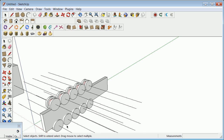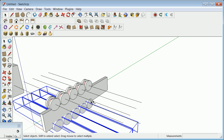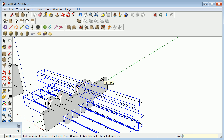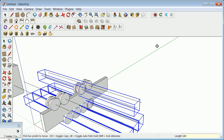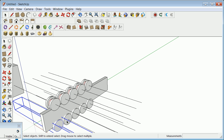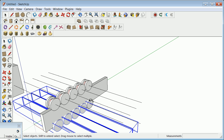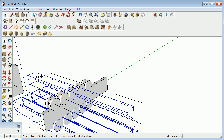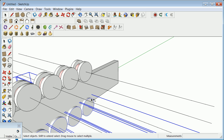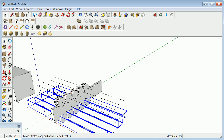Now these, however, you might want to shift. You remember you made this 160, you might want to shift them all 80. So I'm going to grab 1, 2, 3, 4, 5. Realizing that you can, like the relative, you can go here, get it along that distance, and say 180. And I grabbed too many, so I'm going to go Edit, Undo, Move, try to grab them again. 1, holding the Shift key, 2, 3, 4, 5. Looks like it grabbed this one up on top. So I'm holding the Shift key and not grabbing it. Holding the Shift key, then grab that one. And now I'm going to use the Move command, and I'm going to move them 80.